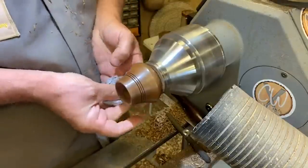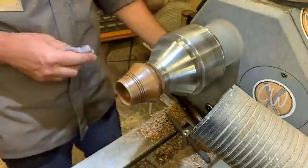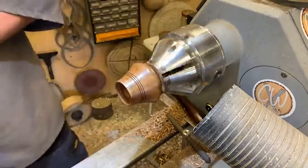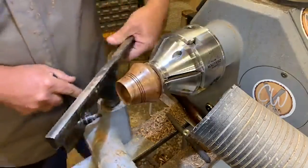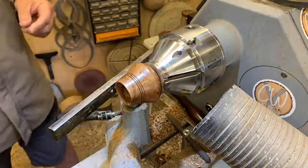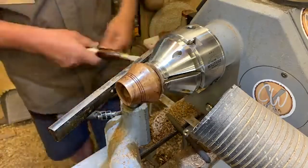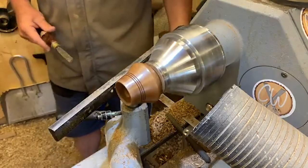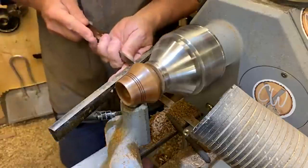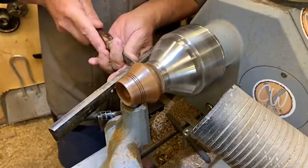Question from Keith — are the OD jaws that you can put inserts in okay? Absolutely, yes, bang on — that'd be perfect. I'm going to part this off now. I haven't left myself a huge amount of space, but just parting off nice and gentle — if you part too aggressively you'll end up with a really big area to clean up. So we'll reverse it on the lathe. We're going with a friction chuck — a jam chuck — to jam inside here, so I can clean up the very underside and put a couple of lines in.